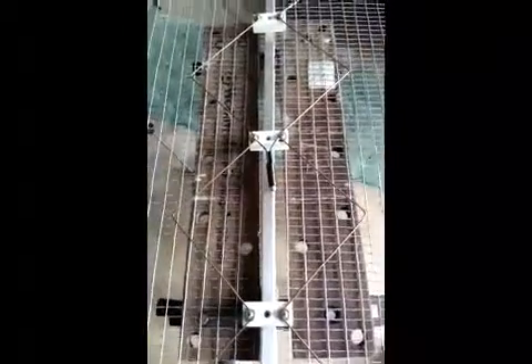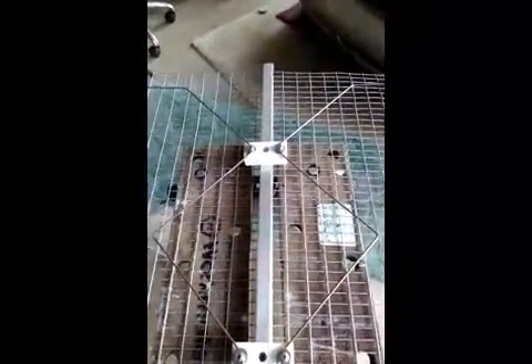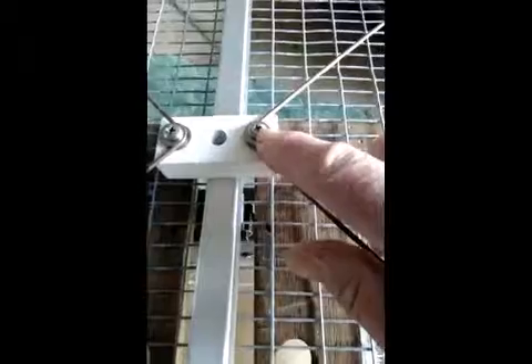This is a finished Gray Hoverman design antenna. It has squares that are seven inches from point to point, and out here they have these outrider bends — a top hat design. I use aluminum. The insulator is PVC lumber, very popular, available in most home stores. I use stainless steel washers and stainless steel screws.